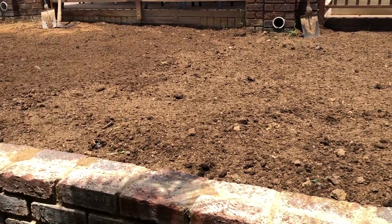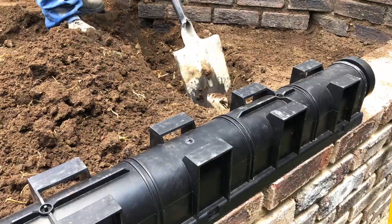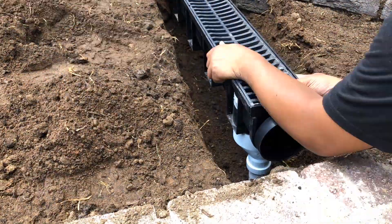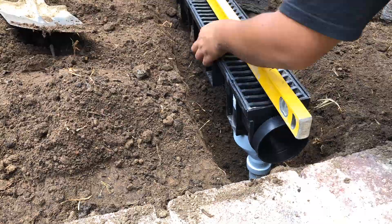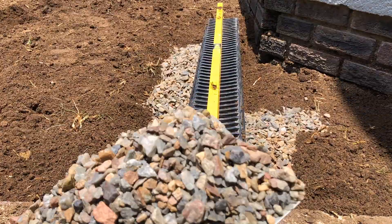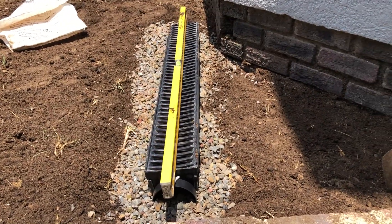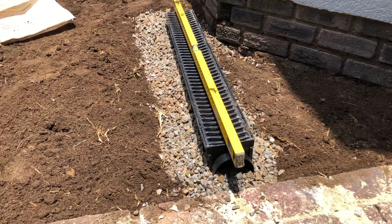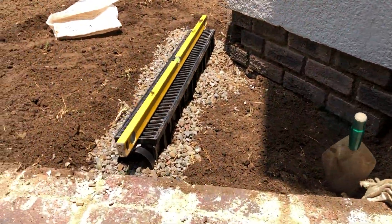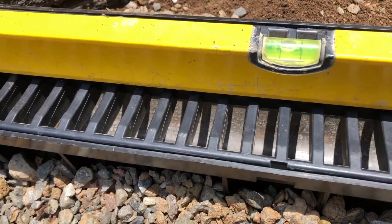Here's a quick view of the overall landscape that has been transformed before your eyes. Previously, that level where he's raking now was on the ground level in front of the retaining wall, so it has increased by approximately half a meter — 500 millimeters. Closer to the house where we've got the channel drain, you would have seen in part one that we dry-fitted the whole system to get the right elevation. Now we are securing it in its final place using PVC glue to secure all the plastic fittings, and adding some concrete to keep it secure for good. We've also got our spirit level on top to ensure we've got the correct runoff from the back to the front, with a gentle gradient for the water to run off.